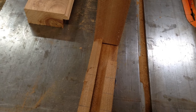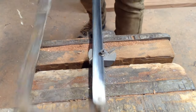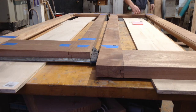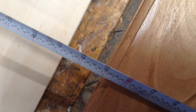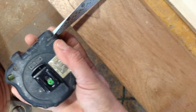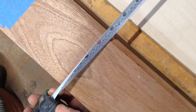The problem with the kit I had is the ball bearing won't give me enough depth on the cope. I tried to find one that matched the profile with no ball bearing on top and couldn't, so the way I solved that was I just cut that ball bearing off. The last time I made panel doors like this was five or six years ago — that video is on YouTube — so I don't make these often enough. I wasn't super worried about taking that bearing off. In order to figure out the math for this, you basically have three measurements because these are going to be mortised into the rails and stiles, the cope has to fit the top side of the profile, and it also has to fit the rabbet as well.